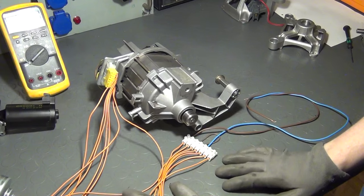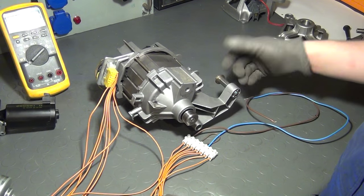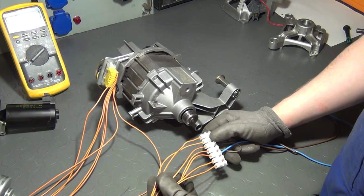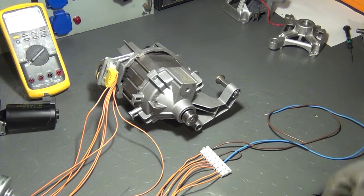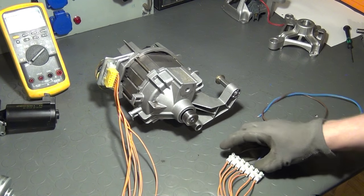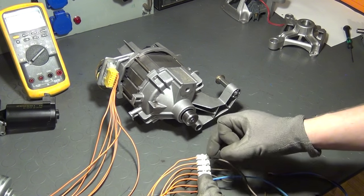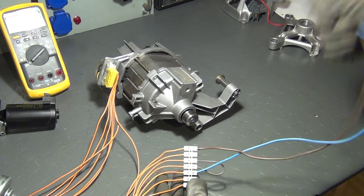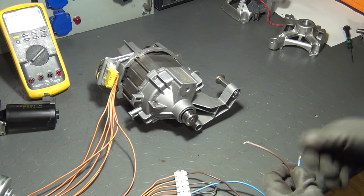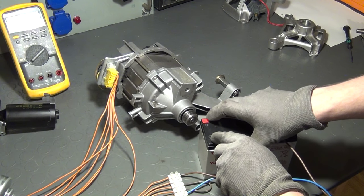Here we have one of the universal motors which I salvaged from a washing machine, in this case from a higher-priced Siemens brand machine. As you can see, seven leads are coming out of that motor, which can be an obstacle for someone who is basically just a hobbyist — they will probably be very confused by having more than two or three wires. What it is about those seven wires — and sometimes even more — will be explained in the next video. For now, I have basically connected the exciter winding and the rotor in series, as it is supposed to be with a universal motor. Just as a little demonstration, here is a 12 volt lead acid battery, and we can connect the motor to that — as you can see it spinning up. That's the practical demonstration of the fact that a universal motor can run on DC as well.